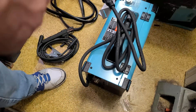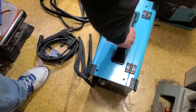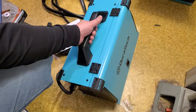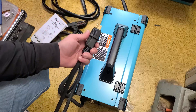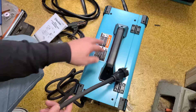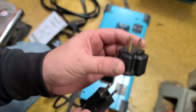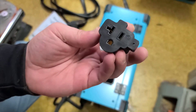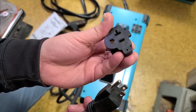So, weekend warrior grade. The other promo welder I reviewed was the ProStormer, and I wasn't sure if this one is 120 volt only — it took a second to figure out. These cheaper home welders are single voltage only, so they aren't auto-detecting 220 — they can only be used on 110. Even that other one I got is also 120 only. Hilariously, they advertise it includes an adapter to go from supposedly 20 amp to 15 amp, but they just put a 15 amp cord end on instead of one with the prong turned sideways, so this adapter is totally pointless.